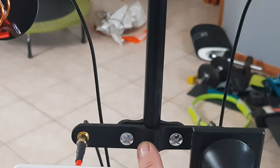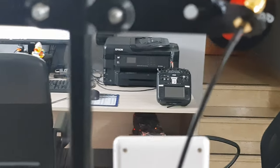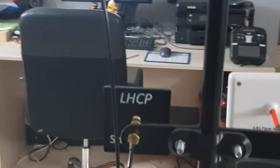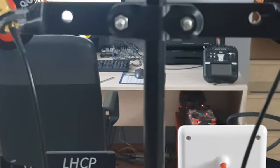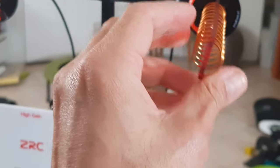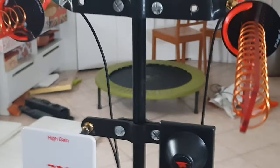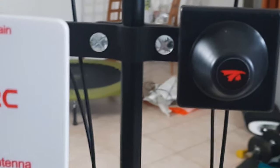Those two parts are 3D printed to hold the antennas together, and on the back you can see the screws which keep everything in place. The holes are where I put the RP-SMA cable extensions going from the goggles to the antenna stands. The four receiving antennas I will be using are: two Prodrone.pl 12-turn helicals, the ZRC flat panel antenna, and the TrueRC Sniper.